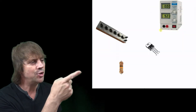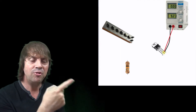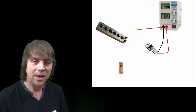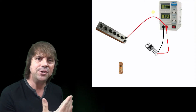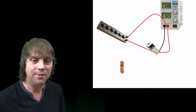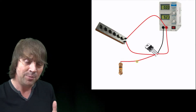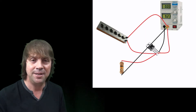To get the MOSFET transistor to switch on we effectively need to fulfill three conditions. One condition is that the source connection is connected to the ground or negative of the power supply. The drain connection — the middle connection — must be connected to the power supply positive. The third condition is that for this particular type of MOSFET we have a positive voltage between the gate and the source. This one requires a positive voltage of about 3.5 volts in order to get it to conduct, but once you get to 3.5 volts it conducts an awful lot of current, and that's what we need to test the power supply.